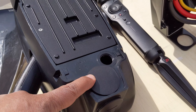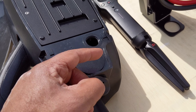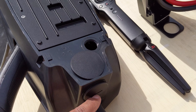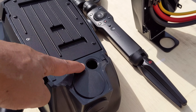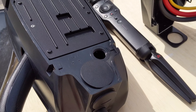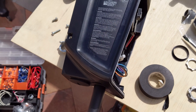What you're gonna have to do is take the plug from the top mount bracket — this pops off — and put it in here behind to seal up that hole in the back. The only thing that will be exposed is the hole where you're gonna fish your wire through. I initially thought they only gave you two plugs for the front holes, but all I had to do was get this plug from up top, plug it in, and then I still have this one hole open for my wire.